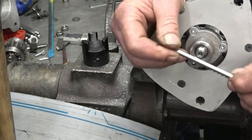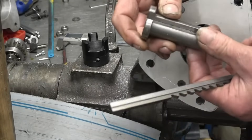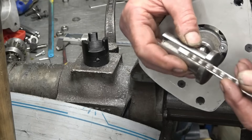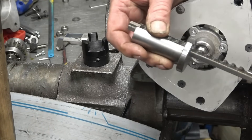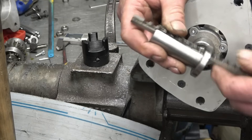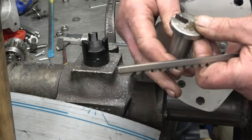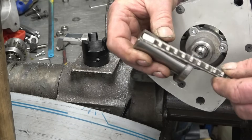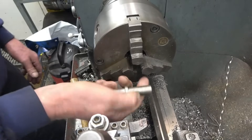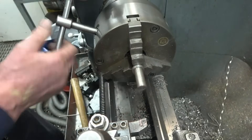I've got lots of broaches but I haven't got a 3mm broach, so that's why I had to borrow one. That's the sort of thing we need to make an adapter — that's a bigger broach obviously. It fits into the hole for broaching; these teeth get gradually bigger and bigger and they're pressed through there, and that cuts the keyway. Once you've cut a little bit you put a shim in behind there, take another cut, and you carry on until you get the keyway cut to full depth. It's slow and old but it always works.